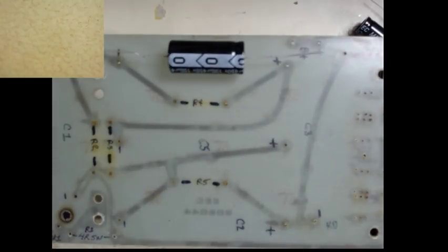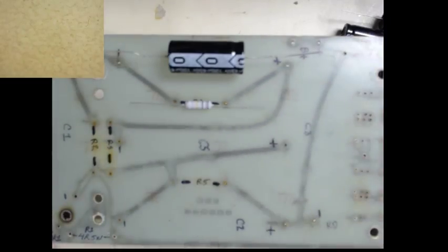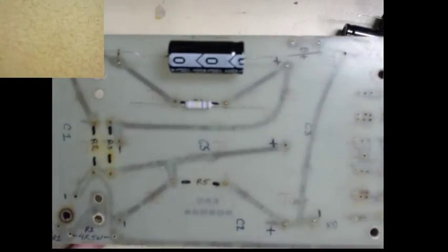Then we'll be laying out one of the balancing resistors will go there. So these are 180K 2-watt metal oxide, I'm pretty sure metal oxide resistors. And what they do is after the diode stack, they help balance the input voltage and current across all the different capacitors, so that way you don't have one capacitor at a higher potential than the others.